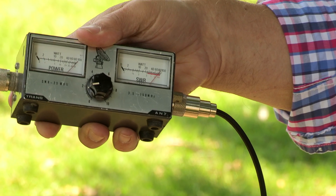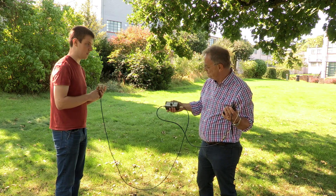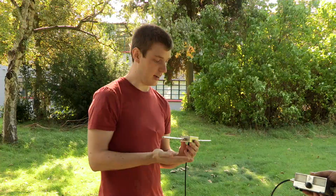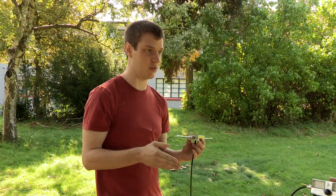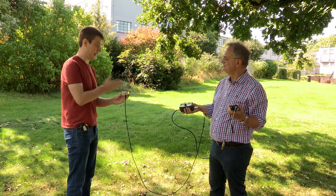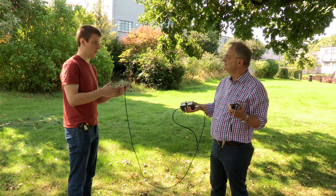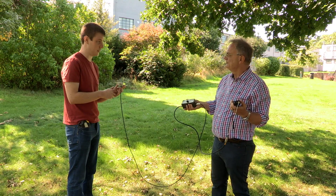The SWR doesn't look so brilliant - we've got end stop on that, and the object of the exercise is to get it as low as possible. The ideal SWR is a value of one. A dipole antenna should be about half a wavelength long - one meter total - and this antenna is clearly too short. So we are going to lengthen the two arms, making sure to keep them the same length, and the VSWR should decrease as we get closer to the antenna working best on two meters.